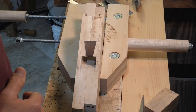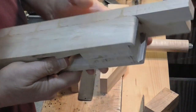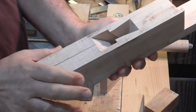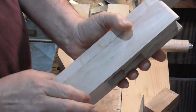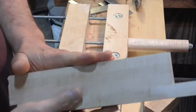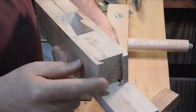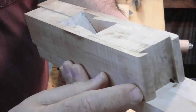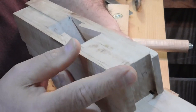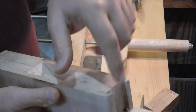The way things fit are going to be more important than how large or small things are. What I will do next is square the entire plane up and use calipers to make sure the sides are parallel to each other and the top and bottom are parallel. I'm going to square up all the corners, flatten everything, and then round the corners. I've already rounded these front corners because you can't get down at the bottom to do all this work.